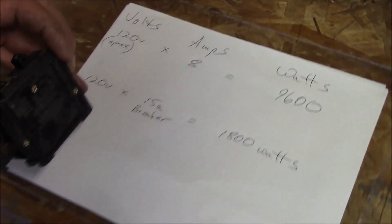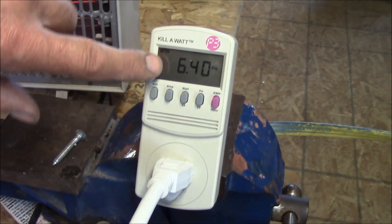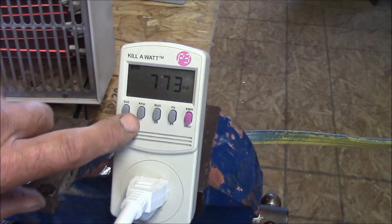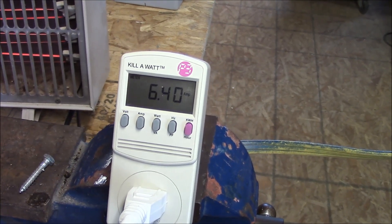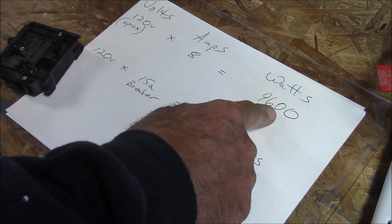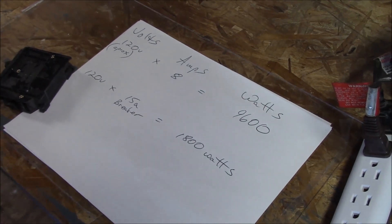I want to show what can go wrong when you're plugging stuff in. You don't realize that even though you're in two rooms, those two rooms could be on the same circuit, and if they are, that circuit only has 1800 watts available. We set up our kilowatt meter here and we turn on a heater trying to keep that back bedroom warm. Here are my amps: 6.4 amps. We can go to watts real quick — that's 771 watts. I'm really going to be interested in the amperage because I have 15-amp wiring feeding my rooms. I have 15-amp breakers. This little formula — watts divided by voltage (about 120 volts) equals amps — lets you make sure you don't add up more appliances than your circuit can stand.